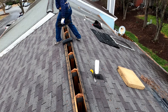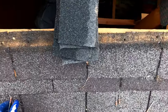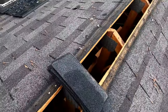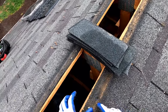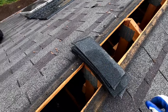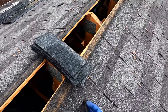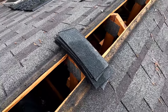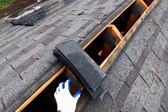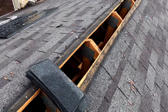In roof repair, I guess a good term would be non-standard, because you never really know what situation you're going to be dealing with on any given repair. Sometimes you do non-standard. You know, the standard thing on this would be for this decking to come up another 1.5 to 2 inches, and then just be able to actually replace that one tab going all the way across. Because of this situation where the decking's cut back further than expected, you can either go to the expense of taking out about 3 or 4 more runs of shingles, cutting out the decking and putting in a larger piece, because you can't just put in a 2-inch strip of decking across here, because that's so weak that it's just going to break when you try to nail your new nails through it.